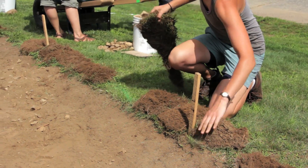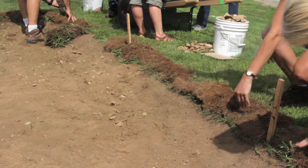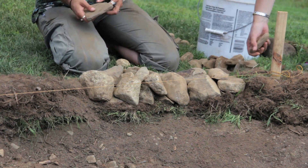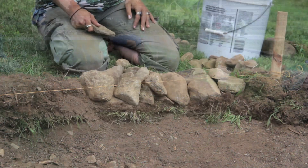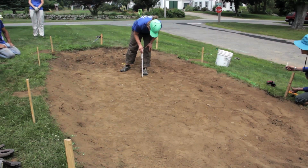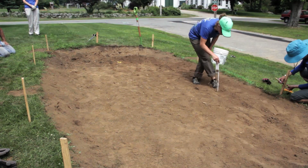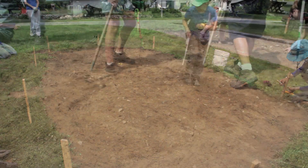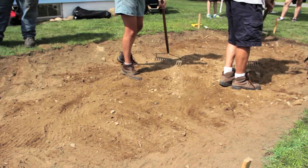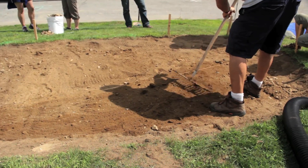Berms can be made out of soil, or in this case, the sod that was removed earlier. While building the berm, you should also build the outlet. Building an outlet allows larger storms to safely overflow out of the rain garden and reduces damage to the berm or plants. Once all of your stakes are marked, you can use the string and level to make sure that the bottom of the rain garden is flat. You can do this by measuring the distance from the bottom of the rain garden to the string. You may find that you need to dig out additional material or rake it out to get rid of high or low spots. A level bottom helps the water spread out more evenly throughout the rain garden to maximize the surface area of the soil and distribute water to plants.